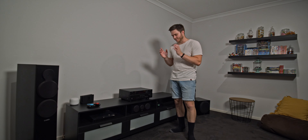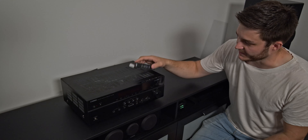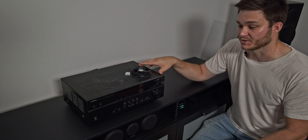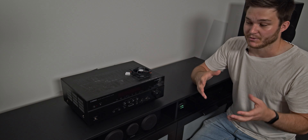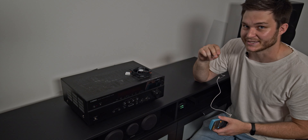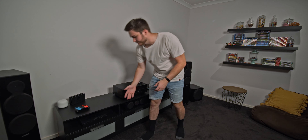So I've got a plan A and a plan B, and hopefully at the end of today we can chuck this receiver in that hole and it'll be sweet. Plan A is to add some fans into the receiver — these are going to add some airflow to help cool it down when it's in that tight, confined space. We're going to add a temperature controller so the moment it gets too hot, it will turn the fans on. But to know how hot it should get, we're going to have to take some readings, so I'm going to watch some movies and get this thing nice and hot, then take a temperature probe to find out just how hot that heatsink inside gets when it's in an optimal cooling position.